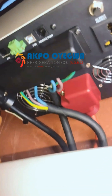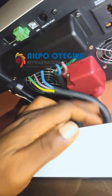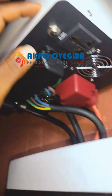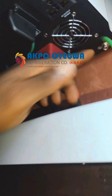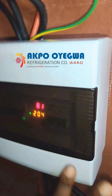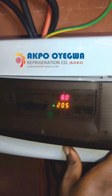The next two black cables are indicated here as going to the battery. The black cable is for the negative terminal of the battery, and the red cable is for the positive terminal. Up here is the bonding cable. The bonding cable is necessary in case there's a short circuit inside this metallic device — it transfers current that would otherwise pass through a person's body down into this protective box, which contains the protective devices installed for this equipment.